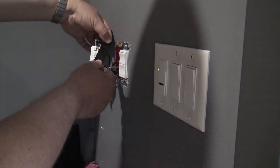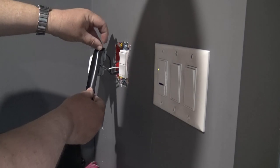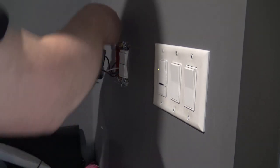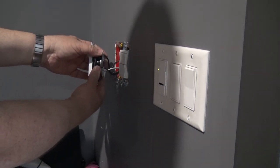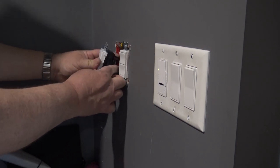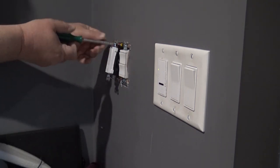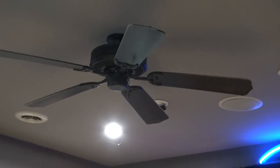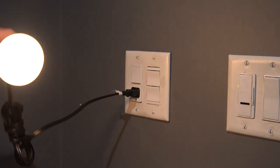Once again I'm going to wrap the terminals with black tape - only because I'm working on a live circuit and I'm going to have to handle this to get it into the box, and I really don't want to get a shock. I just wrap a strip of black tape around the terminals to give a barrier protection. Not necessary if the power is off. Most electricians do work live - especially when you can't turn the power off, you have to take all the precautions and not electrocute yourself. So put the plate back on - final test. Fan's working! Let's check the plug - plug in a light. What do you know, an old Ikea light still lights. Thanks for watching.